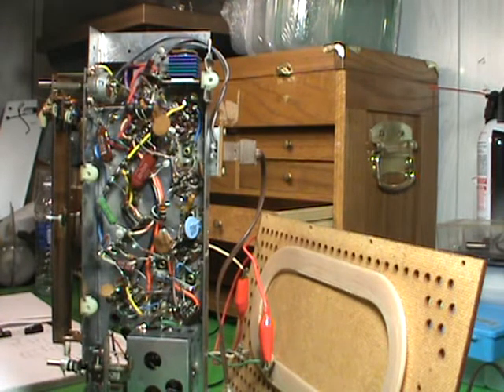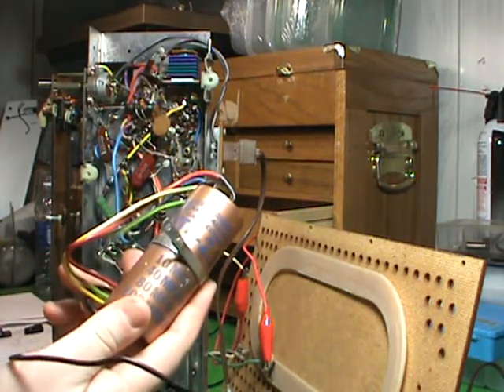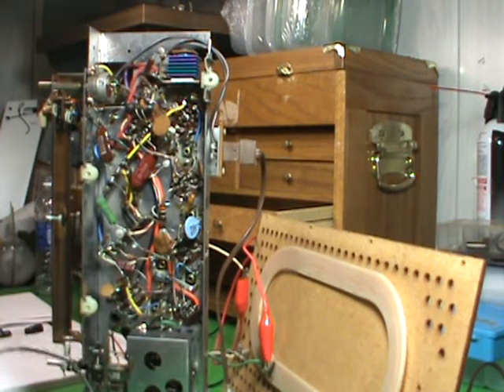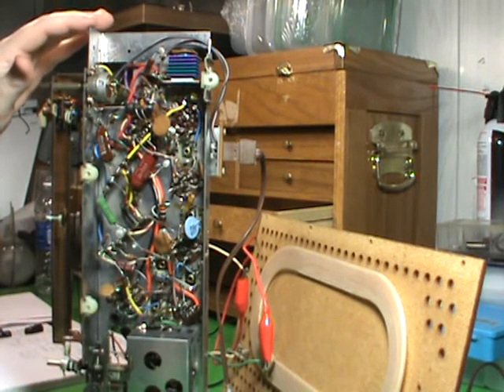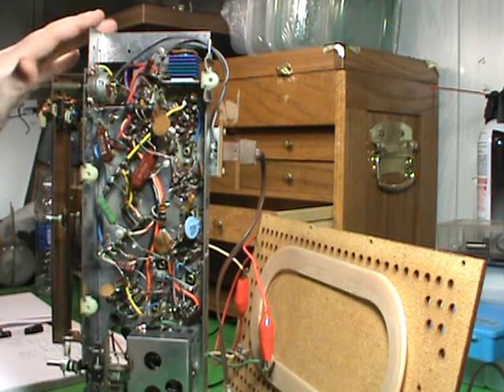Now, to test to see how it is, I have a multi-can capacitor which has four capacitors in it with a shared ground to test it. I use this instead of a regular capacitor with long leads — it's just easier. So, on this radio the chassis is ground. They use the chassis as the ground, and I'm running it through my isolation transformer, so it's safe to touch.